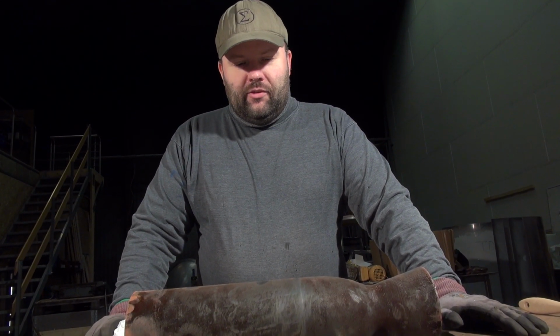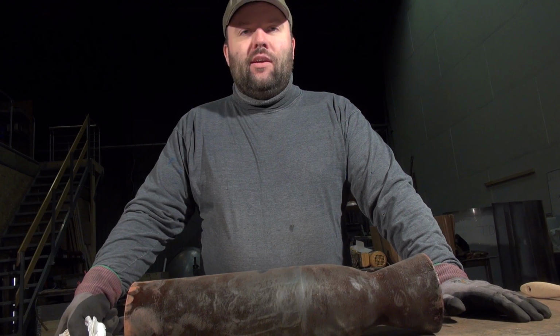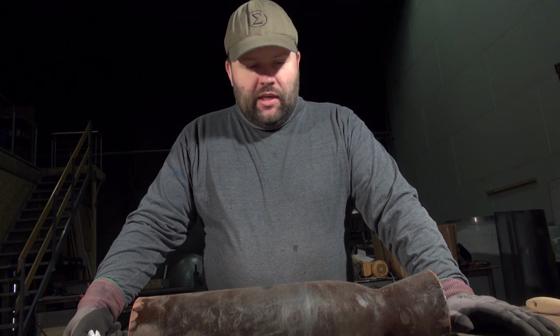The results look somewhat ambiguous. It doesn't look like very clean, fresh, new, shiny metal. So something has definitely occurred during the tempering process. We have one or two different theories here. One of them is that these liners were not properly degreased and cleaned before we put them in the oven, which means that it is basically burnt oil we are seeing on the surface. The second option is that the protective inert atmosphere wasn't sufficient to prevent the tube from oxidizing.